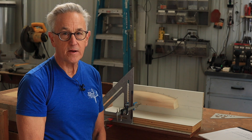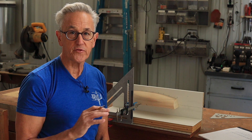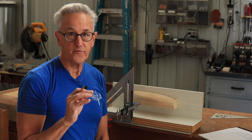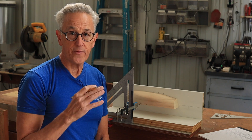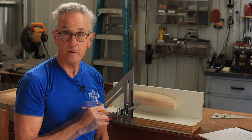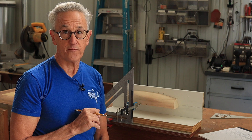So that's the last measurement that I need for my table. Now it's my understanding that Captain Nat's offset measuring device actually took into account the scale of the model, so the readings that he got were actually the offsets for the table of offsets. That table went directly to the shop floor and they were able to start laying out the boat. Mine's not quite that sophisticated, so what I'm going to need to do is to draw a line plan in order to scale off of that and get a table of offsets.